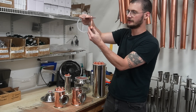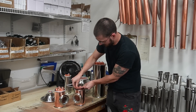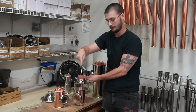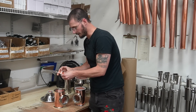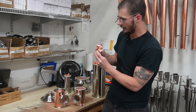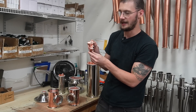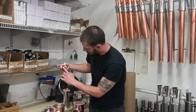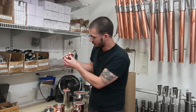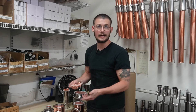You're going to crisscross these, so one section is going to have it up front of the glass and the next section will have it on the back — they kind of beeline in a way, and that'll give you the right flow. Now bubble plates are doing almost the exact same thing. We have tiny slits in between each of these caps, and as the plate sits in here, vapors come up, they go through these tiny slits, and lighter vapors are able to push through to the other side while heavier vapors fall back down — exactly the same way.